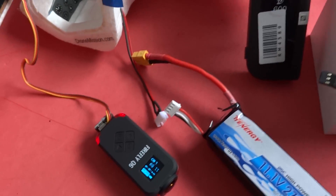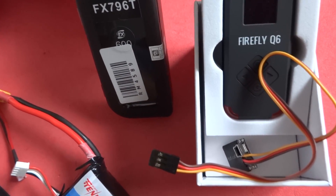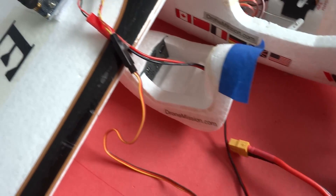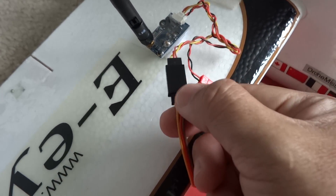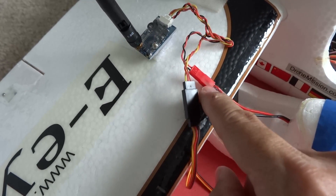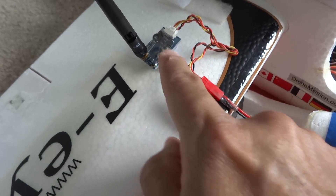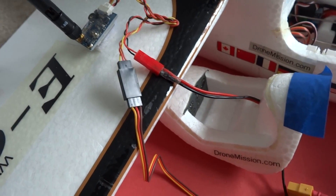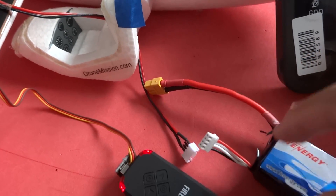If you've purchased a Firefly Q6, it comes with an FPV cable and a voltage regulator, two-in-one. All you do is hook it up to this video transmitter — you see the video and signal coming in right here via the Firefly Q6 cable. The power supply uses a JST plug that comes with the video transmitter. You can power it off a 2S LiPo battery, or as I did, off the balance port of your main flight battery.